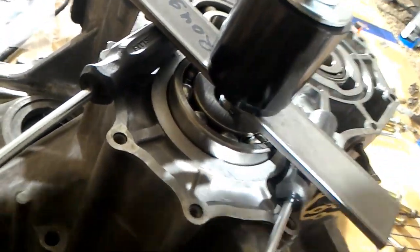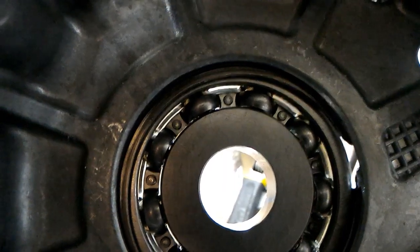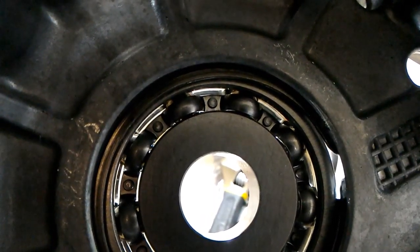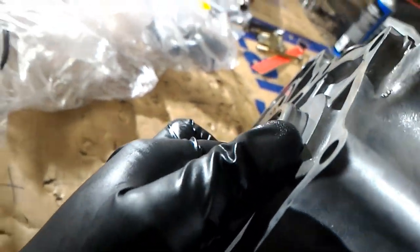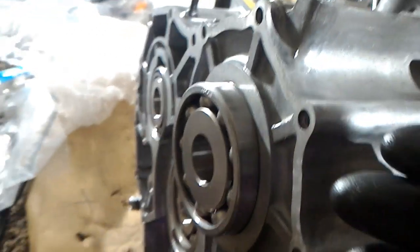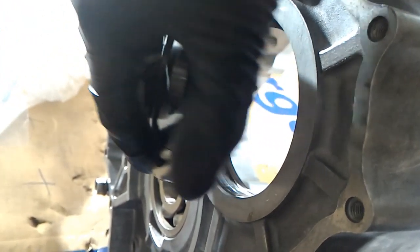I think it's actually spinning now. The circlip has jumped all the way to the bottom of the bearing, but the bearing is not completely out yet — it's mostly out but not completely. You'll probably have to use a punch carefully so you don't damage the wall. With the punch on just one corner on the other side, I barely had to use any pressure and the bearing pretty much just came out.